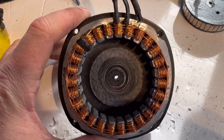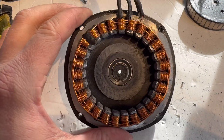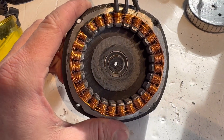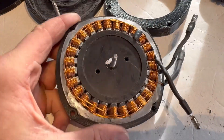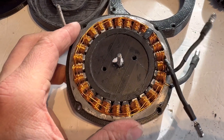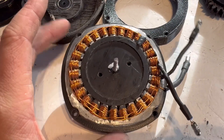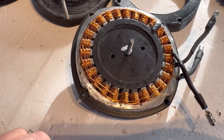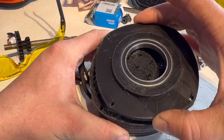It was then time to get winding with 0.5mm wire, doing two layers on each slot. Something that makes winding harder is the fact this is an in-runner motor. The reason it's an in-runner is because it's attached to a planetary gearbox where the sun gear is the input. To make it an outrunner motor there would be a couple more manufacturing steps to make the rotor. If I can get it to work as an in-runner, that will be much easier from a manufacturing point of view, even if it does make it slightly harder to wind.